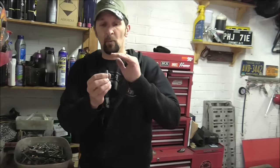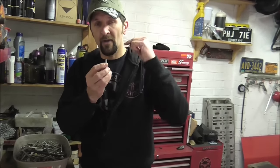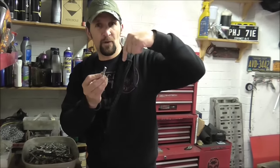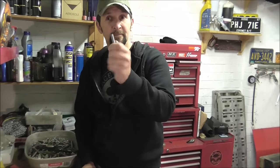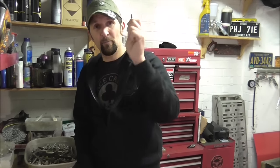So there we are. Take the time with little things like that. When you're modifying and building stuff yourself, that's a craftsmanship attitude to cutting the end of a bolt. You can use a disc grinder if you want — it doesn't make any difference how you cut it, but once you cut it, make a nice job. The whole principle is: use split nuts to hold it in the vice, and taking those nuts off carefully will clean the end of the thread for you, without the need for taps and dies or expensive tools. Be a craftsman in your garage. Do a good job and nobody can criticise you. Ride safe, thanks for watching, see you next time.